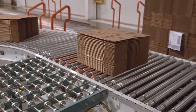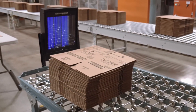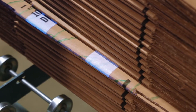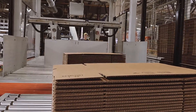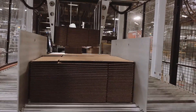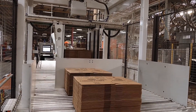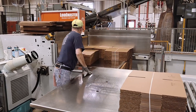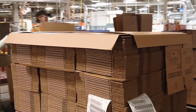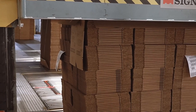As the bundle travels down the conveyor system, a black light detects the UV coating and ejects the bundle so that an operator can locate the off-quality box and remove it prior to reaching the customer. To account for the speed of production, a doubler is used to assist crew members in combining each bundle in preparation for load forming. The doubler stacks bundles on top of each other, and these combined bundles are assembled into a specific stacking pattern to meet customer needs. Load tags are inserted into each unit to uniquely identify each load as it is sent to shipping for delivery to the customer.